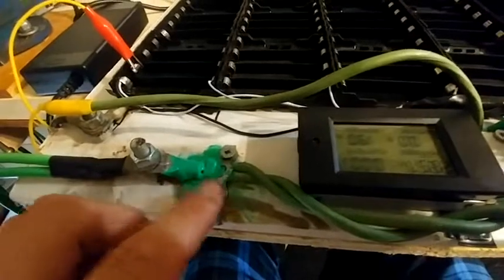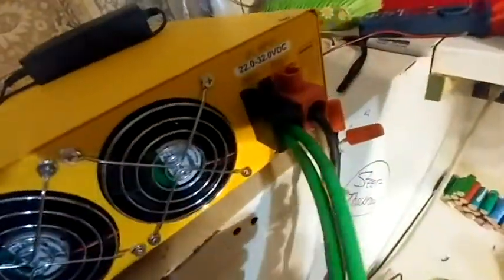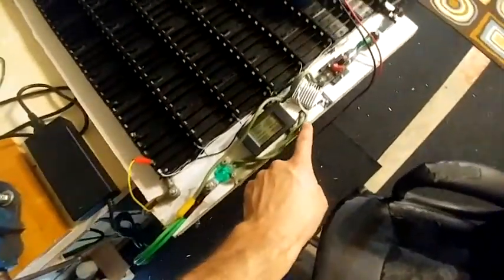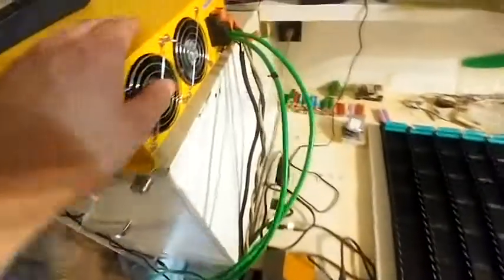So I grotted a bit, and I put a ton of liquid tape everywhere just to be safe, and I'm probably going to put even more safety stuff down. I got these hooked up here, very thick wires for the negative side. But it doesn't matter because this is still going to be a choke point right here, and this is going to warm up. But if we're below 40 amps, I'm not concerned whatsoever.